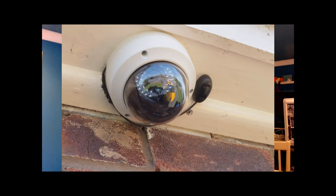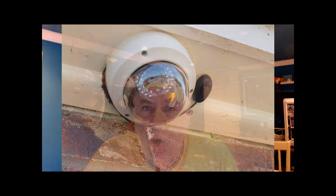So I have rigged microphones up to a couple of the other cameras, and they are very, very sensitive, and they pick up sound great. So if you're happy with your dome cams, other than the nighttime rain infrared problem, this is the way to go. So that's basically it. I'll just talk you through the software now and how to disable the infrared emitter in each one, and I'll show you some comparison pictures using the internal emitters and the external emitters in exactly the same conditions, the same rainstorm, and you judge for yourself which you think is best.